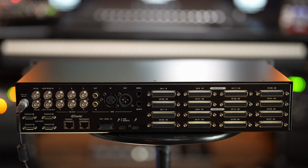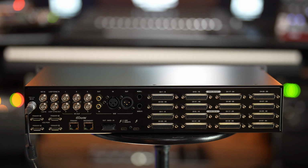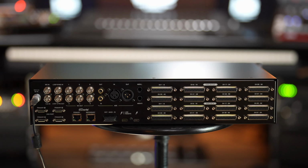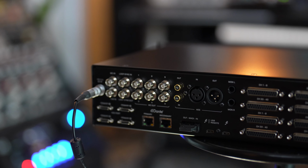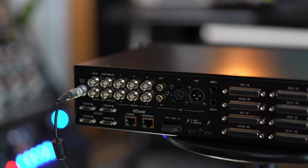Now, I still have the monitor outputs left and right, which is a higher dynamic range one, and the Galaxy 32 had that one as well. And then it's Thunderbolt 3, similar, but the difference is they added 2 ports now instead of 1 port. The Galaxy 32 only had 1 port, this one has dual. It just comes handy if you want to daisy chain this along your unit or connect a second thing to it, like a hard drive or a monitor or screen or any Thunderbolt device. I kind of like that. Now, they also have SPDIF input and output, same as the unit before. They have 64 channels of Dante at 48 sample rate, similar to before, which I use in my setup.